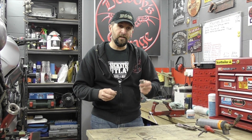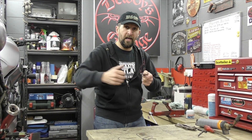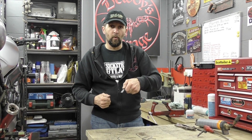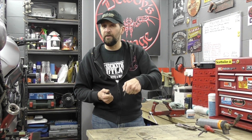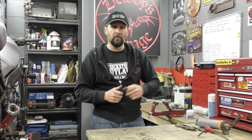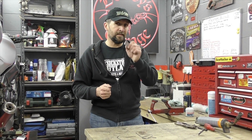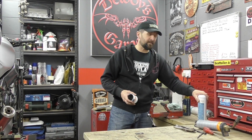Now if you quench in water, the shock is such that it will likely crack the metal. You could make a beautiful blade, quench it in water, and hear it go bang bang bang, crack crack crack — it's ruined, literally scrap metal. But if you quench it in oil — go back to some of the samurai sword videos, those TV shows from the 70s made into YouTube videos — you'll see those guys making samurai swords using oil to quench the blades. That's what I want to do today.